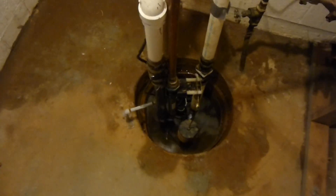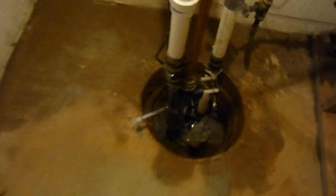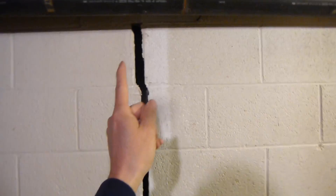What's happening here — there goes the pump that just kicked on — the foundation is being washed out. Over here we have this big crack in the basement wall. That's probably an inch and a quarter wide, and it goes down. There's nothing at the bottom, so the top's cracked and is wider than the bottom, so we know it's going like that.